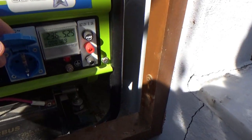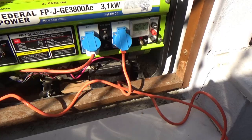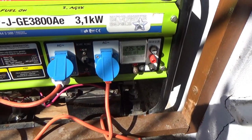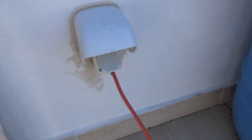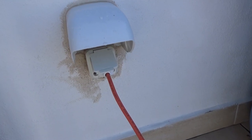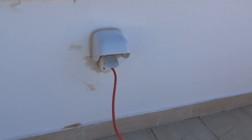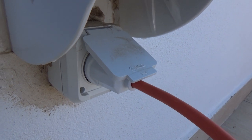Having plugged in the electric cables to the input plugs which lead to the sockets in the house, we now have to plug them into the unit. You can see here that there are two waterproof sockets that connect to the outgoing electric to the sockets in our living room and office. We can run our TV, lights, computer, internet, and a small electric fire comfortably off this generator.